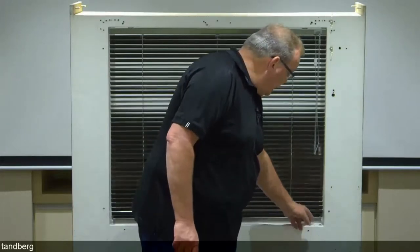As I said, if you need to pack out, you can use soft shade extension brackets, you can use timber, you can use other things to do that as well. The hold down brackets down the bottom, which is our clear little L bracket, which holds a pin, might have to zoom in on that one, Trev, I don't know whether you can do that, but that little pin there actually fits on the bottom of the bottom rail, just to hold that Venetian from swinging around. As I said, they come standard except on your limited edition. The end mount brackets are the optional, usually just used in those commercial environments, but again, keep in mind, maximum blind width is 1 metre.